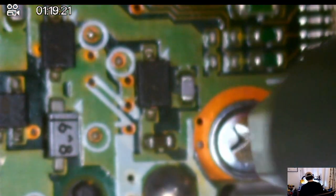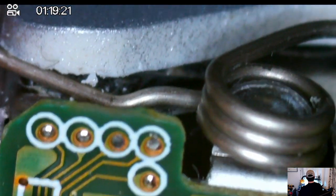The process of reassembly is pretty straightforward — it's like the reverse of what you did, according to the service manual directions. Putting back the screws so now the main board is going to be screwed back to the actual mechanical portion that moves the minidisc playhead around. This little tension spool was rather hard to understand from the service manual how to put back, but it seems like the right orientation is to line it up and then tuck it into that corner.